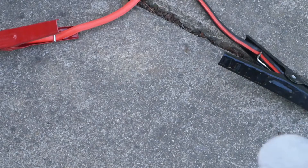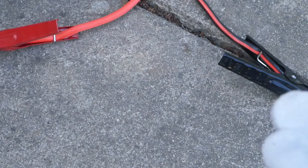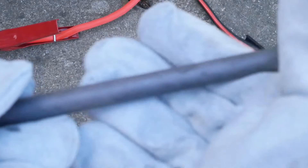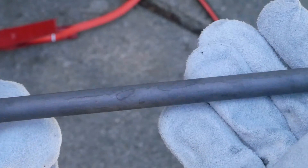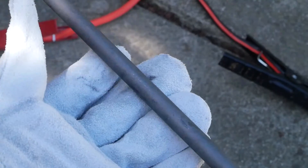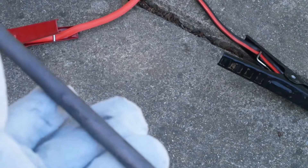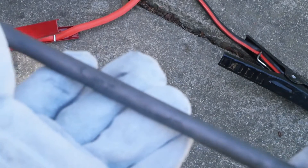So what are we going to use as electrodes? Steel? No, it's just going to melt. Tungsten? No, it's just going to vaporize. So what we're going to use is this huge graphite rod. I got this on eBay. We're going to cut this thing in half and connect each side to the clamps, then put it inside the crucible and see if we can strike an arc.